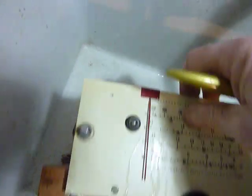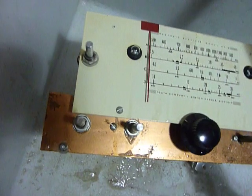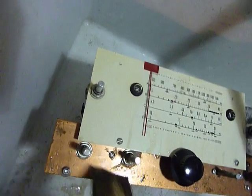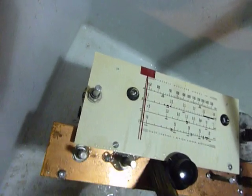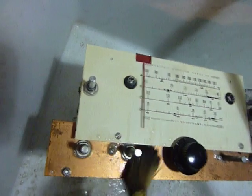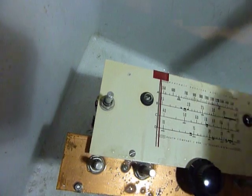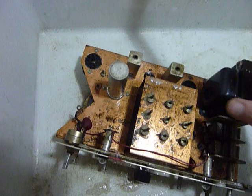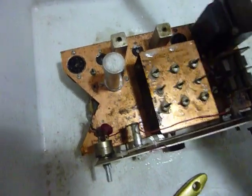We did get a call from one guy — one of the other technicians talked to him — and he said, 'I baked it at 350 degrees just like you said.' And then he said all the plastic parts melted and the thing was just ruined. So first of all, you want to be absolutely sure you take the meter out if you're baking an HW 101 or something like that — you've got to take the meter out.